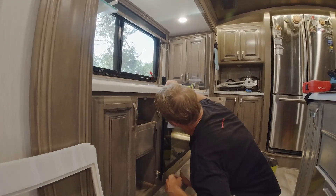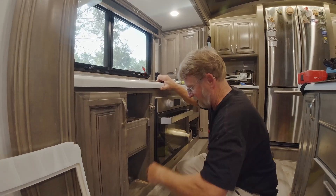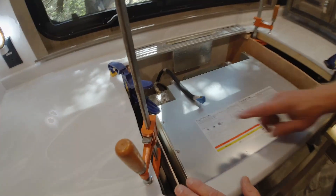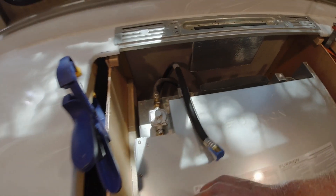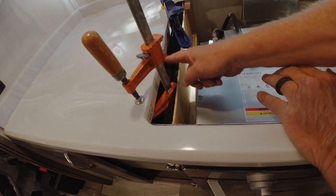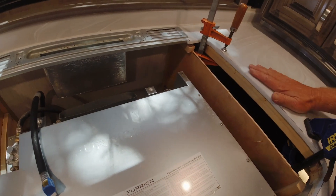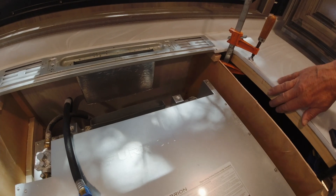A little behind the scenes of the animal in the wild as he works on his project. We've got the cutout done, we've got the cabinet cutout, and I've got this cutout for the vent. I've got two 2x2 cleats glued in here just to support this counter. The factory didn't have any counter support on there, but I'm putting it in because this is a slightly heavier cooktop by about 20 pounds.